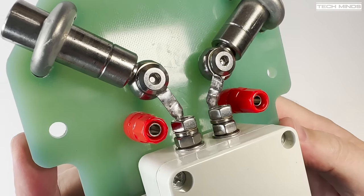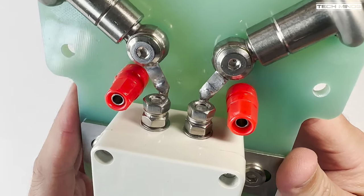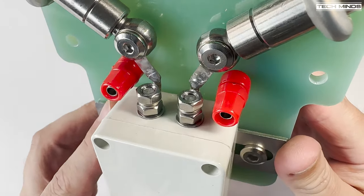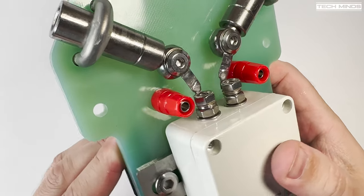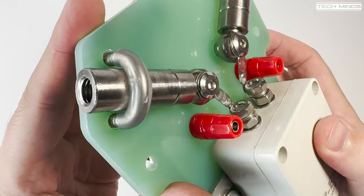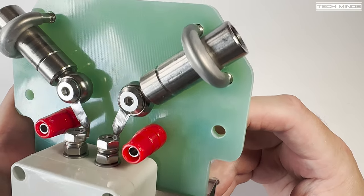By taking a closer look at the mounting bracket, it's clear that the antenna threaded sockets can be moved from the V position to a horizontal position, meaning you can use this antenna as a V style or horizontal. To do so you just unbolt the little U bolts and move them down to position. Apparently V style will be preferred for DX whereas horizontal is better for more local communications.